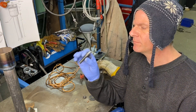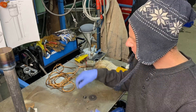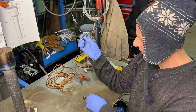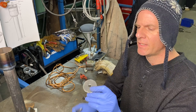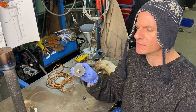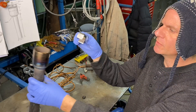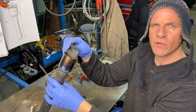Now that we made our gas fitting, we have our barbed end, our through hole at about 200 thou, and our tapped hole for our modified MIG tip. You can see I shortened the 035 MIG tip and it goes right into the end like that. I also cut out a small piece of 316 flat stock and drilled and tapped a half inch 13 hole — this is going to be our air regulation washer. Then I bent up some 316 by 1 inch flat stock to hold our valve on the top of this burner, and we're going to weld that on top.